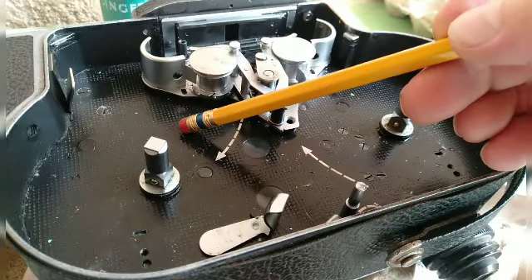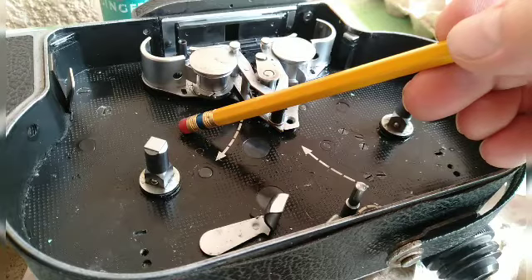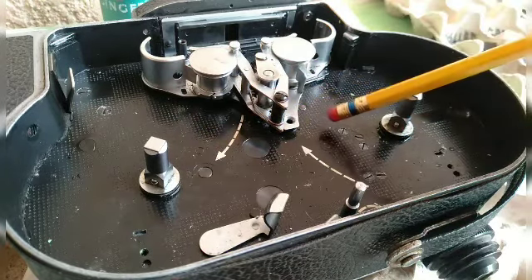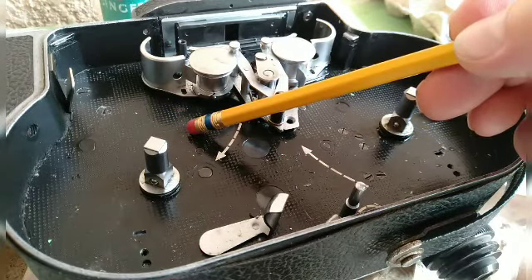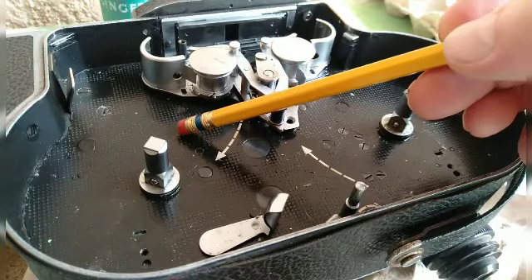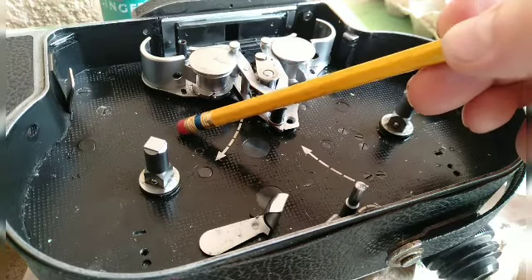So remember, when you're going to take on this type of job, when you buy this type of camera, the work cannot be rushed. It's a long haul overhaul — it takes lots of time. The worst part probably is freeing up all these little screws and the larger screws here. It doesn't make a difference what model it is. The positive thing with getting a reflex, especially on the H models, is essentially the governor — it is much easier to set and takes a lot less time and effort.